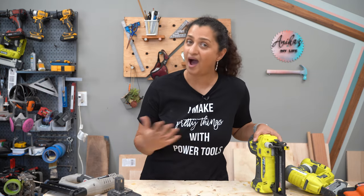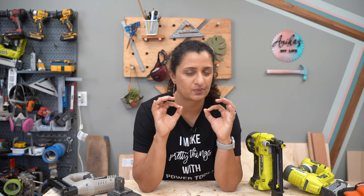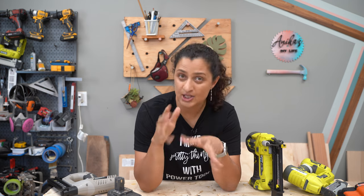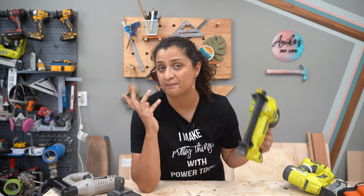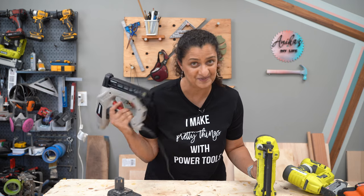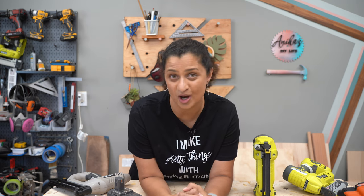Finally, the most asked question: I am a beginner, which nail gun should I buy? That depends on what kind of projects you're doing. If you need maximum holding power, a 16 gauge nail gun is your answer. If you'll be doing a lot of delicate work, you probably want a pin nailer. The 18 gauge brad nailer is right in the middle and can be used for both situations, so if you are just starting out I would highly recommend an 18 gauge brad nailer. If you have the budget, it's a great place to start; if not, an electric nailer works too. I'll add links to all these nail guns in the description. Let me know your questions in the comments and which tool tutorial you'd like to see next. Thanks so much for watching!